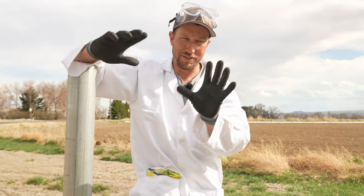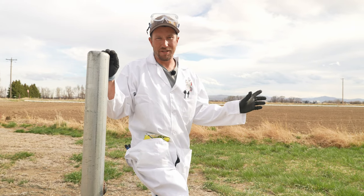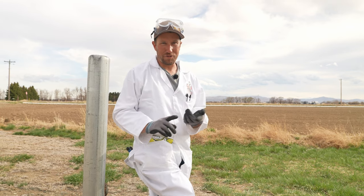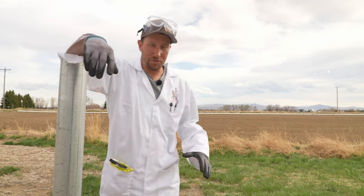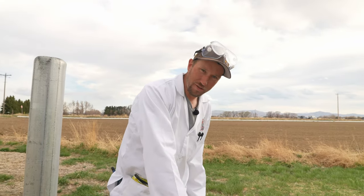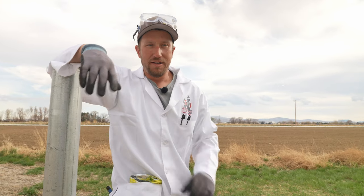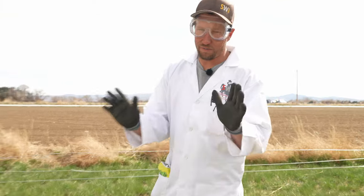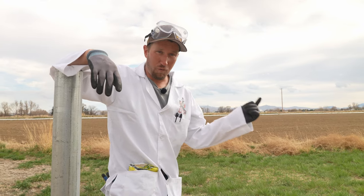I have a theory here — hear me out because this isn't just willy-nilly. On a single strand high tensile 12 and a half gauge run as a tension wire, I think I have reached a conclusion that I would go to a high tensile crimp or a high tensile knot, because of the impact — if somebody was trying to climb over that fence, I'm wondering if that one wire would fail. Now on a woven wire standpoint, a gripple all the way, 100% hands down — because you have various amounts of wires spreading the tension out across all of them. You're not getting anywhere near that 800 pound load limit. Hands down to gripple because it did fail where they said it was going to fail at and there was no slippage. The gripple was a gripple gripple and there was no slipple gripple. It's still a great product, but on one single strand as a tension wire, I'm thinking I would go back to a high tensile crimp.